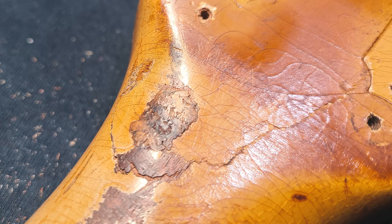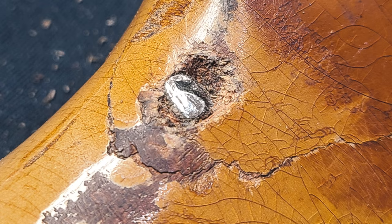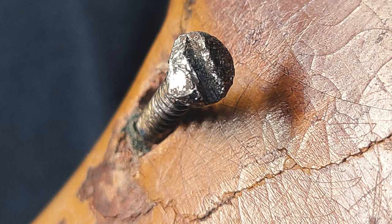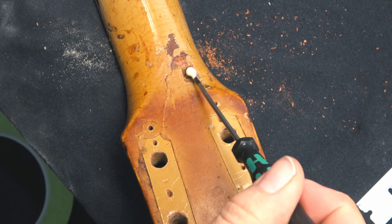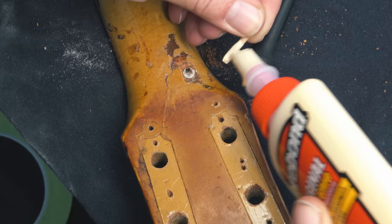Moving on to the headstock, which I think is one of the most amazing repairs I've ever seen. The headstock originally had a very nice crack going through it — typical Gibson broken headstock — and then Joel started digging into it to find that it was hiding a flat-head screw in the headstock. From here he removed the screw and got this area ready to be doweled. It looks to me like he filled the area with glue and then used a maple dowel — you'd want to use something stronger than mahogany — and that's glued and hammered in place.